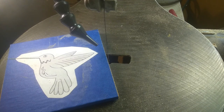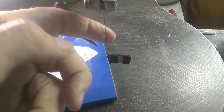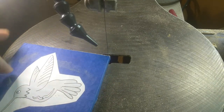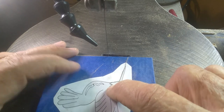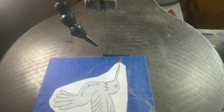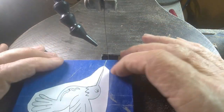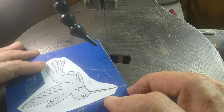The main thing is: when you make a turn, try to keep the pressure against the back of the blade, keep the blade moving up and down, and allow it to work its way around. You don't want to put too much pressure against the front of it, because if you're in a thin material — like an eighth inch — it could jump out into your material very easily. I try to keep the pressure against the back of the blade as I make that turn, so I just want the blade to work its way around to get lined up with the next direction.